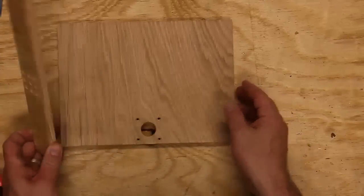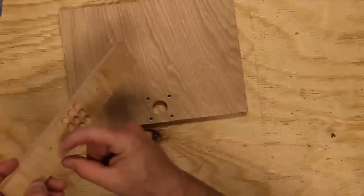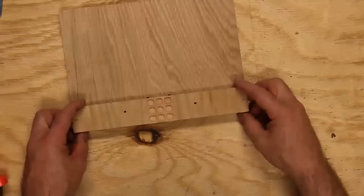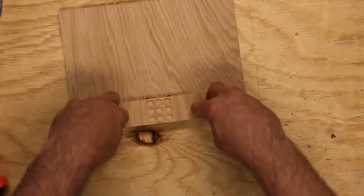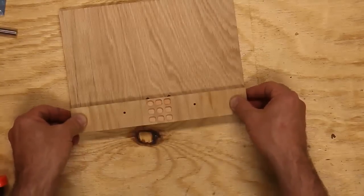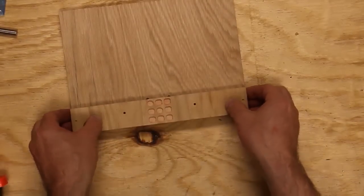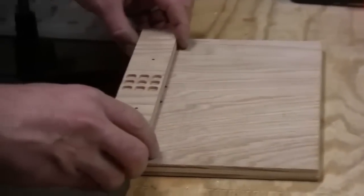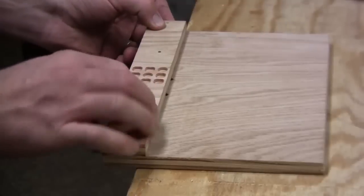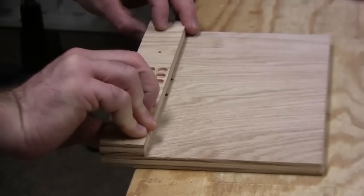We're now going to mate these two pieces — the rear panel with the countersinks on the inside, and the front piece. Remember, this has an orientation: with the larger dimension up to the hole is the bottom, and the top edge has the shorter dimension. We're going to mate these pieces very carefully so that we can do the match drilling. Match drilling both of the holes for the 10-inch rods is really one of the genius parts of the Mantis — that's how you get really good alignment without the entire thing binding up. If you have CNC-cut pieces, they'll line up very well.